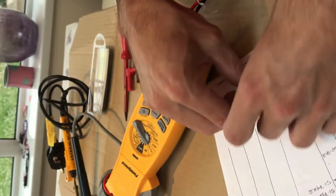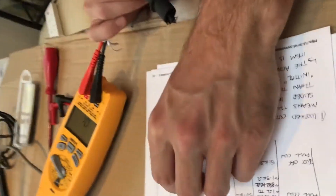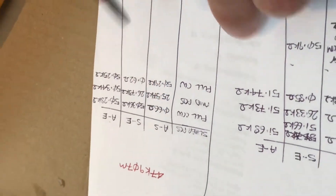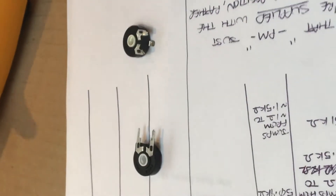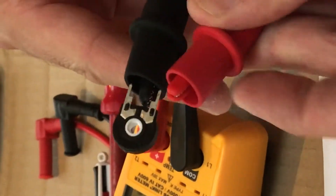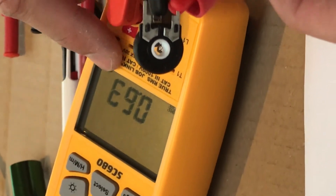I'm going to see what the difference is between these two. I did some readings last night of the new one — on full counter-clockwise, which is all the way to the left, we've got basically a short circuit, just short of one ohm between A and S. If you look here, A is that pin, S is the back pin which is the slider, and E is the one on the right. So to prove that, we should have just about a short circuit between A and S — the back pin and the front left — and we got 0.63 of an ohm, which is pretty much a short circuit.